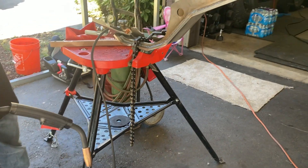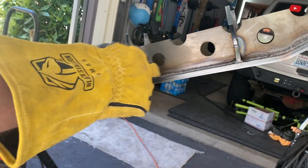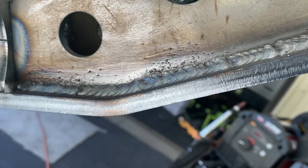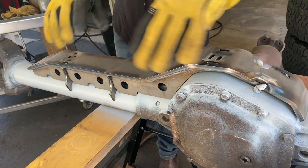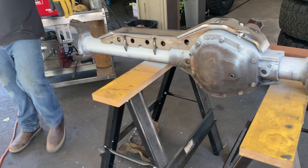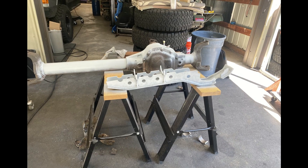In the shop it's more of a stagnant air, but out here you've gotta turn up your gas pressure more. See all the dingleberries? But you're your own hardest critic — the dingleberries just add strength, you didn't know that! Let me flip this upside down on the stand and we're going to do a weldable primer on the inside. Josh put the weldable primer underneath the truss and man, it looks good.